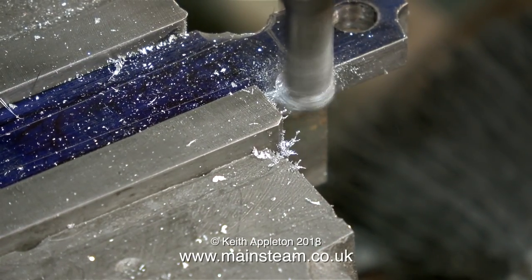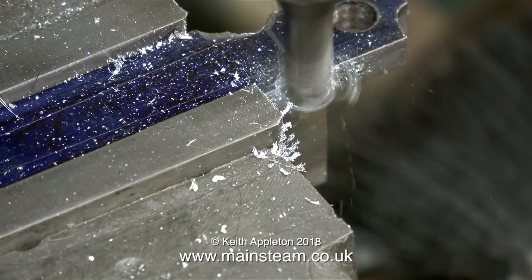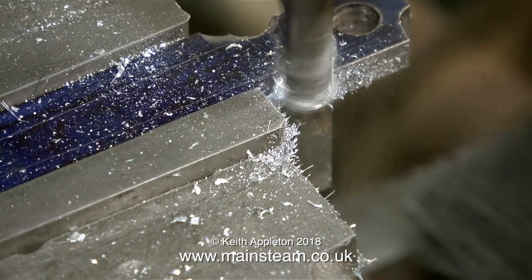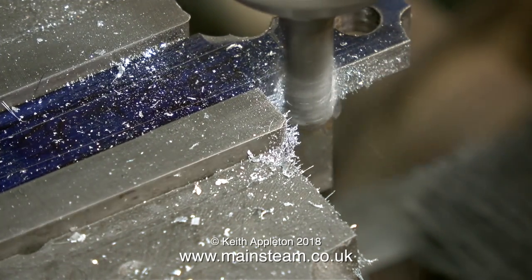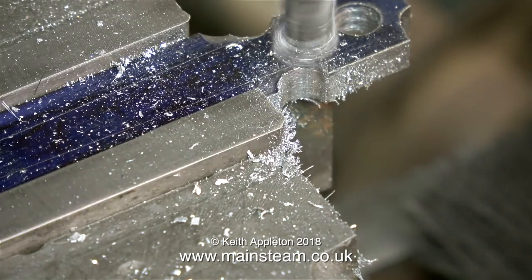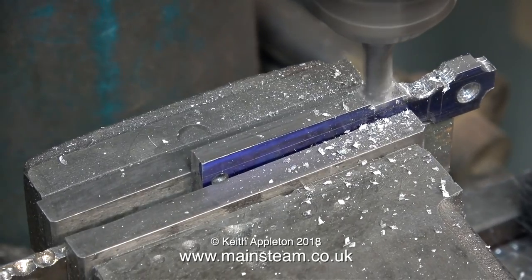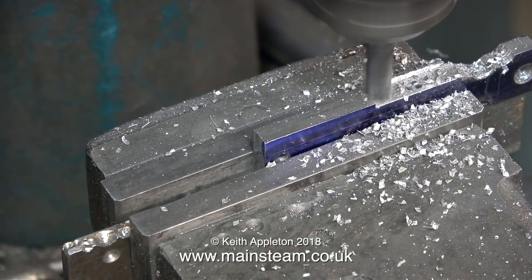This is going to be easy to see because I've moved the milling cutter over to this side. I'm not really following the vernier numbers on the hand wheels — I should do really — but I'm more interested in not cutting past the line. That's the end part of the connecting rod more or less done. Now it's time to reduce the thickness of it.